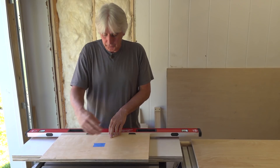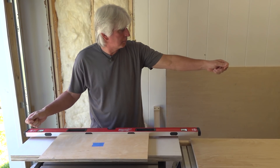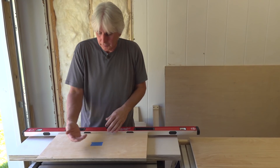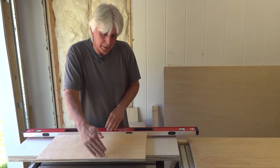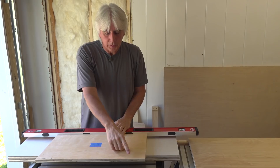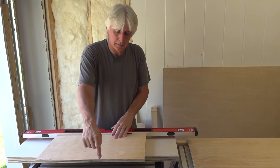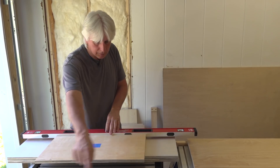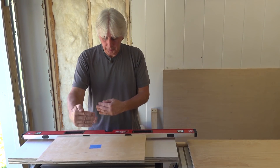You run it through and cut one side. These sides could be off — they might not be perfectly parallel. We might have used our circular saw and a saw guide to make one of these cuts, so it could be off just a little bit. You want them square; you don't want your cabinet leaning sideways. When you make sure your edges are straight and cut the first side against the fence on the table saw, that creates a straight cut parallel with that edge, and the saw blade should be parallel to the fence. So you have created a parallelogram at that point.